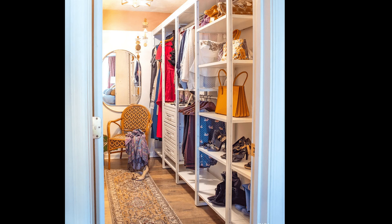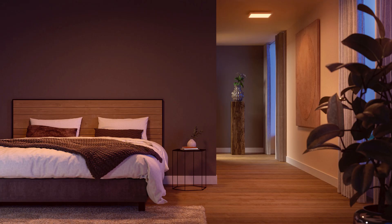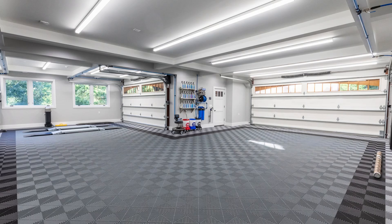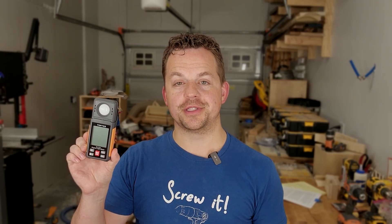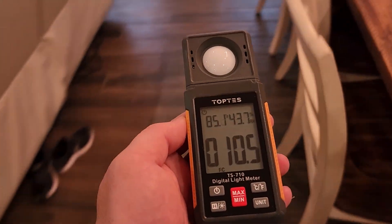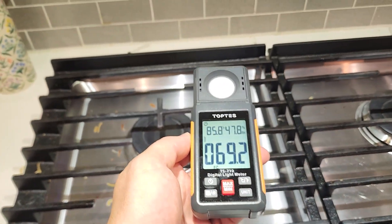Whether it's in an eight foot tall small bedroom closet or on a 22 foot pole in a parking lot, the light fixture is the same. However, the foot candles — how much light actually hits the surface — will be much higher in the closet than in the parking lot. In a typical bedroom you'd need about 10 foot candles, a kitchen around 30 to 40, and a workshop should be 80 to 100 at least. I got a light meter off Amazon and took some measurements. Walking around my house on a cloudy afternoon, I got readings mostly below 20 foot candles, with the lighting under the stove being the rare exception at about 60.